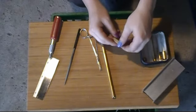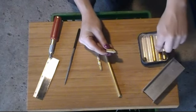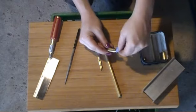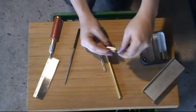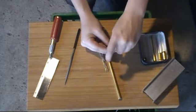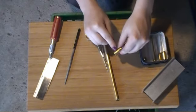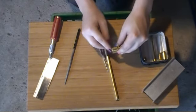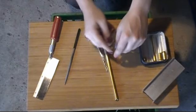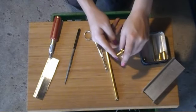The other one's going to be a little different, but here, hopefully it's showing up on camera, not all the holes are covered by the plate. So I just have a piece of brass rod. This is what I cut security pins out of. Kind of get in there. There. You shove that in there, and now it can't fall out of alignment. You drill your pilot holes through the plate, and you don't want to go too deep because you don't want to drill into the core, but you just get your pilot holes popped into the plate, you take it out and finish them. And that's how you get all your holes nicely aligned with everything.